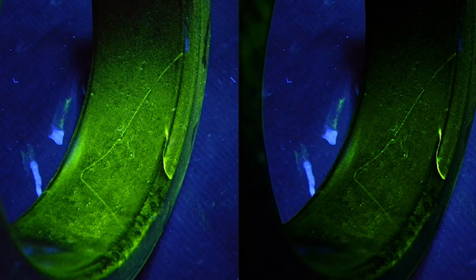However, the rest of the magnetic field will also attract particles to the surface of the part. So just because you have a little bit of flux leakage due to that indication doesn't mean that's the only area where iron particles will be attracted to the surface.